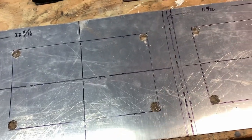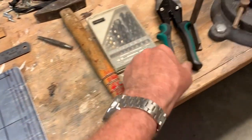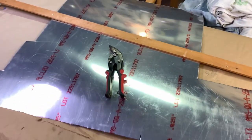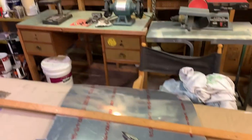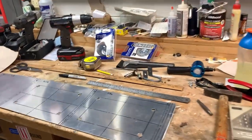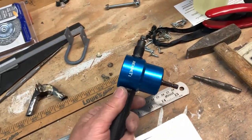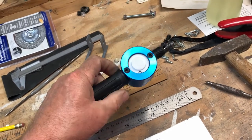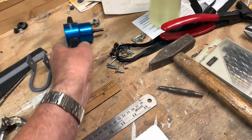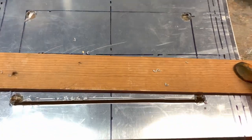I drilled the corner holes already, and now I have to cut this out. I have very simple tools — no sophisticated workshop. I cut everything out with just sheet metal cutters. I have a simple drill press, grinding stone, belt sander, and basic hand tools, but that is all you need. To cut this out I have this nibbler here, and I'll show how I set it up to get a straight cut so you can see that with just simple hand tools you can make inspection panels like this.